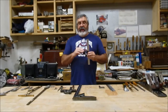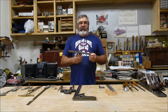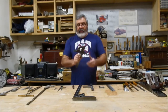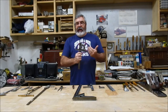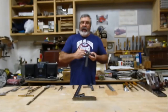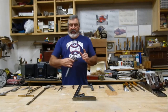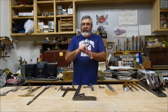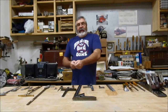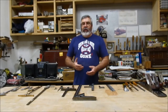Moving the blade in and out a lot, I actually wore out my first head. This part is called the head, this is called the blade. I bought a Starrett combination square in my tool kit when I was in machine trades in high school, and over the years taking the blade in and out I wore the head out. This is a protractor head — we need these for pattern making because we need to put draft angles on there. When I first started I only had one blade, so to switch between the protractor head and square head I'd constantly take the blade in and out, which wore it out. Don't get a cheap square from Home Depot — spend a little more money on your precision equipment.